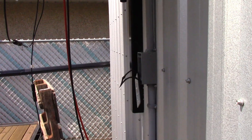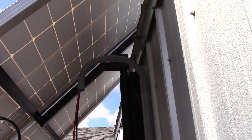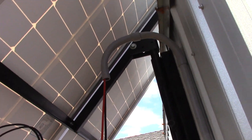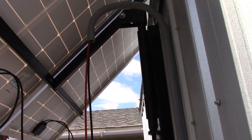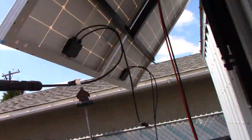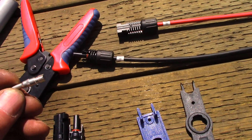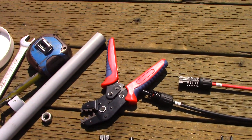I went up from my junction box with a little pipe and two 90-degree bends so rain doesn't go up into the conduit. I'm using three quarter inch PVC, which meant I had to cut the lines because you can't shove MC4 connectors through — you'd need one inch conduit, but that's twice the cost. The MC4 connectors have a barrel with teeth: once you push them in they don't come out, so you'll need to cut and recrimp with new MC4 connectors — a crimper is always good to have.